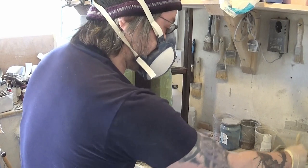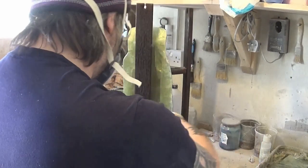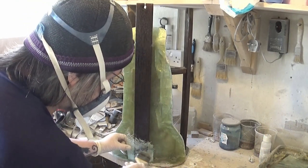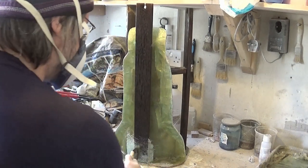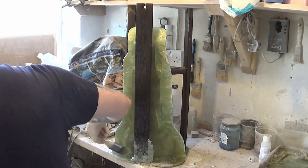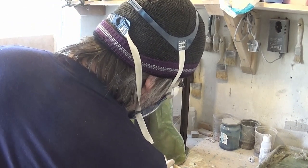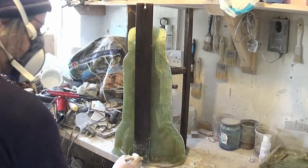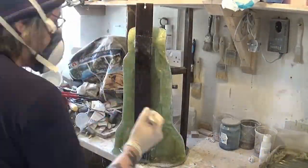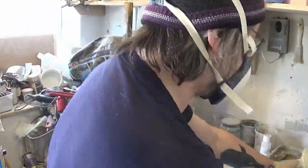I'm just brushing over there with a neat coating of the resin. Now we're putting on the fiberglass matting — I actually cut these bits up a little too big so I did have a little bit of a problem with the legs aesthetically. I should have torn the matting up a little bit smaller just to make it easier to sit around those legs and the mold for a nice neat job. There we are just putting on the fiberglass matting where the legs meet up with the fiberglass mold.